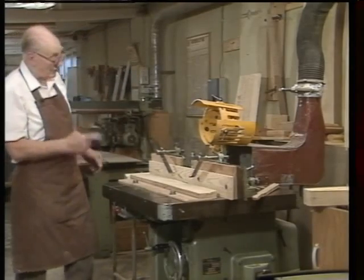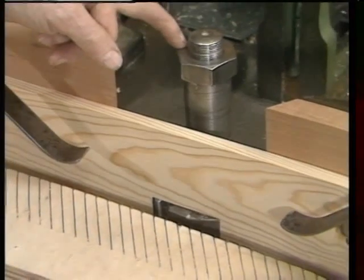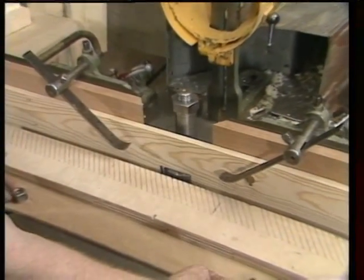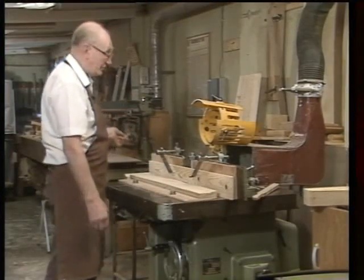Now the machine has been preset for rebating. The cutter block has been preset, a faceboard fitted, and the maker's springs. For lateral pressure, a featherboard is employed. So we carry out our cockpit drill.